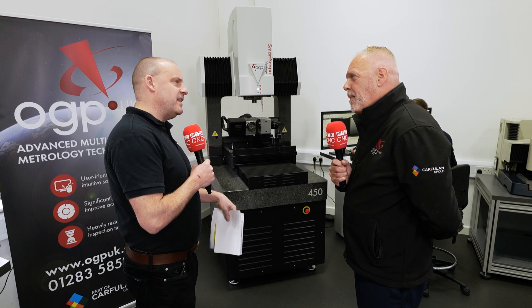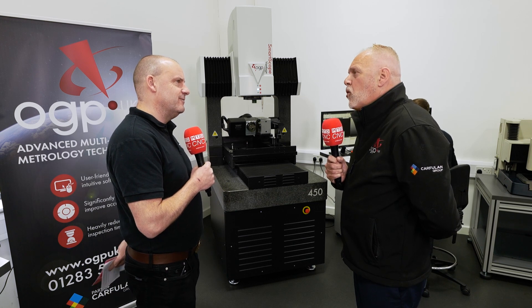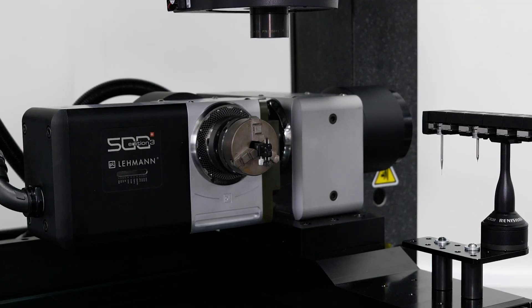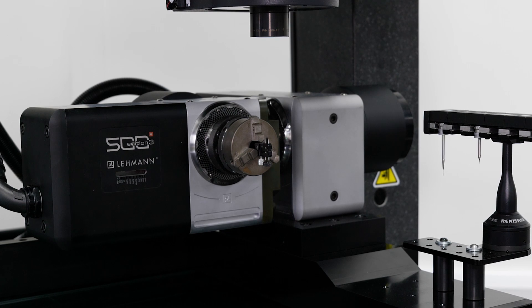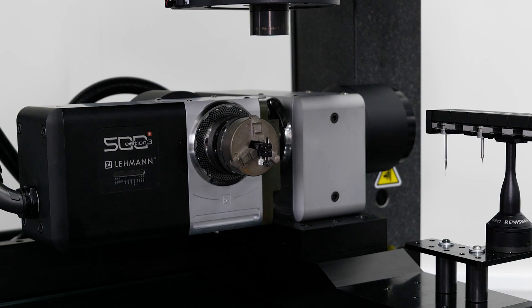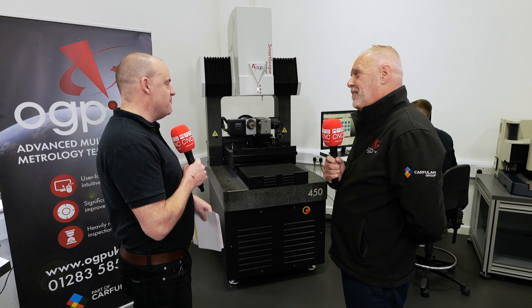When companies are looking at profile measurement in Z, this is where the laser really comes into its own. We have a generous working distance with the laser — up to 200 millimeters — so we can get down into some really serious deep bores. To the bottom of a deep bore, to find out what's actually happening, especially with a blind bore, we can really look at the surface at the bottom and give information back about it.